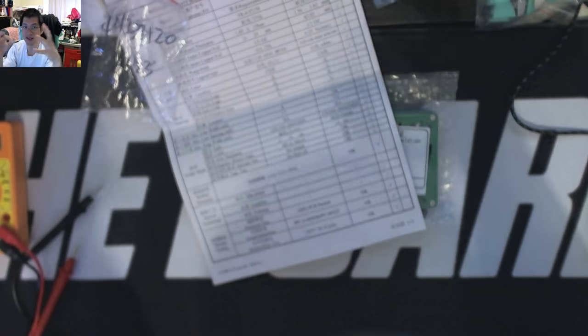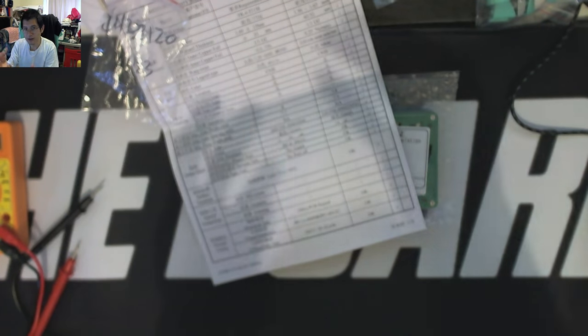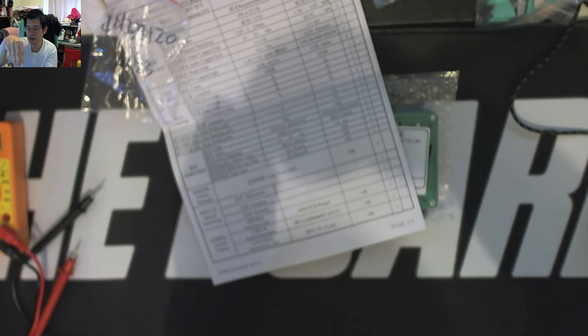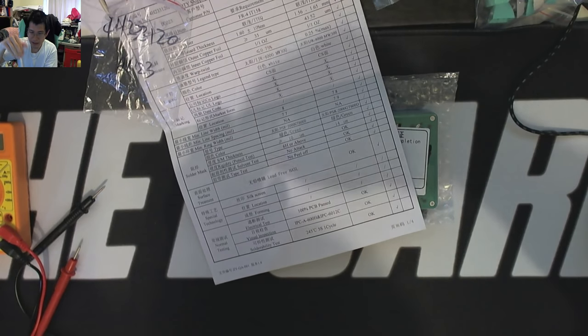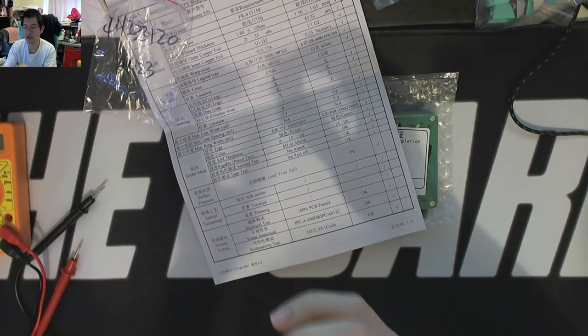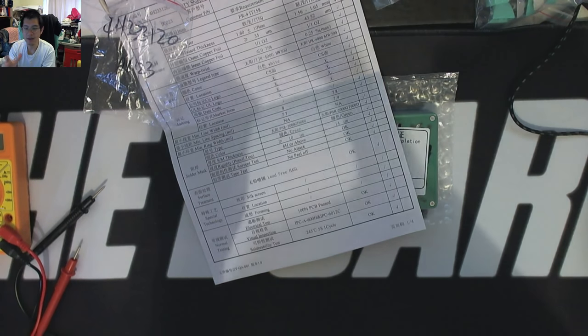But how this specimen is produced is that there's this big machine. It's really big, and there's like a chamber, like a barrel. What you do is you get powder, this white resin stuff, and you pop in a couple of tabs of it into the bottom. And a plunger goes down into it and it lightly compresses it so it forms like a bed. And then you can actually put your specimen into it, in this case, a slice of PCB, and then you put more powder on top. And then it sort of tamps it back down again. Then you seal it up and then it pressurizes it. And what happens is that white powder actually turns into the polymer under heat and pressure. And so once that's done and it comes out, then you can start polishing.